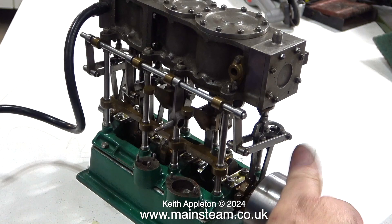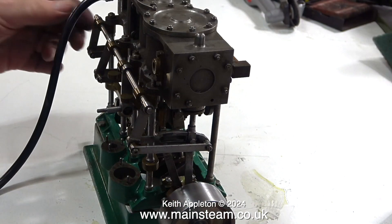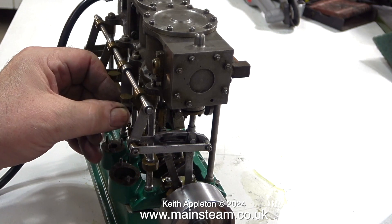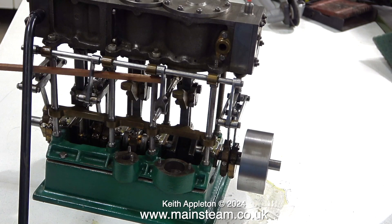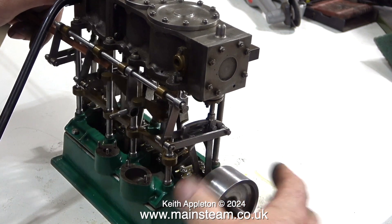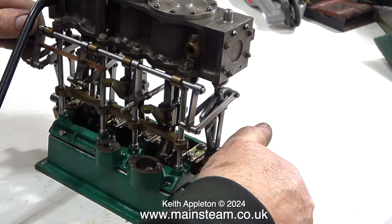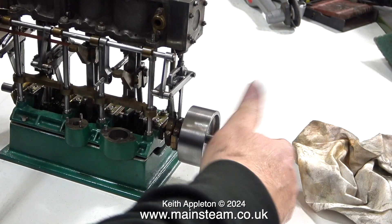A triple expansion engine is not self-starting. In this clip I'm not trying to start it with the airline — I'm trying to make sure the oil goes through all three cylinders. All the valve gear is completely loose and not fixed in place, so I need to find a way of holding the drop arms in place. I found a piece of mahogany to put behind two of the drop arms, but it wouldn't slide all the way along because the drop arm connected to the reversing mechanism was in the way. I turned the pressure up to 40 pounds per square inch and tried to make it go, but unfortunately it doesn't run because the valve timing is incorrect — it nearly goes, but not quite. When I push the drop arms the other way to put it into reverse, it doesn't even try.